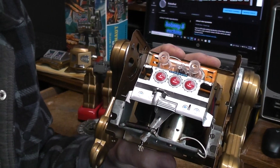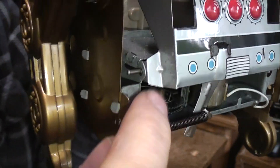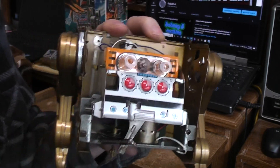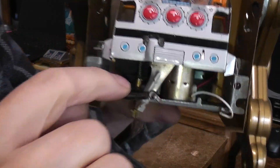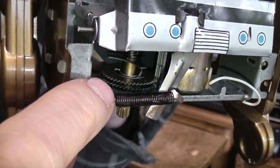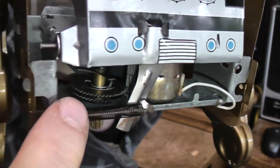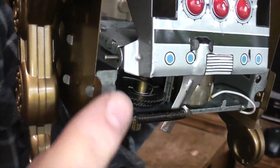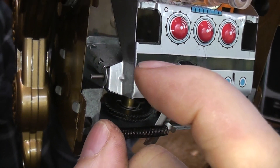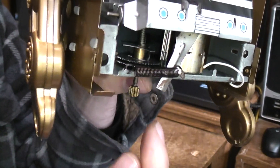Let's turn on this little light just in case that helps. These are the gears down here that perform the shifting — you know, when it goes from walking into Rotomatic. There's a little ramp: there are two gears, and the gears have a different number of teeth even though they're driven by one common small gear. Because they have a different number of teeth, that ramp is going to walk its way around. When it's not in a slot it's going to push the two gears apart, and when it drops into a slot the two gears come together, which causes this gear to raise and lower.